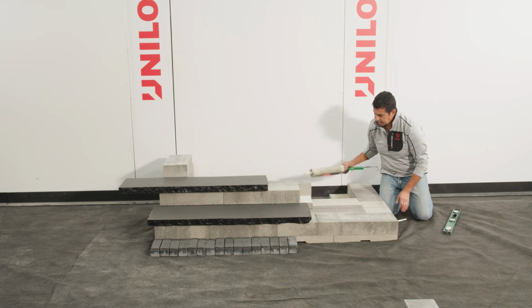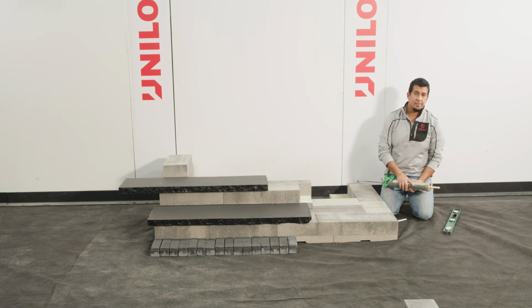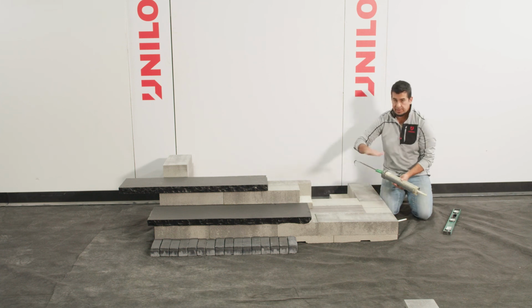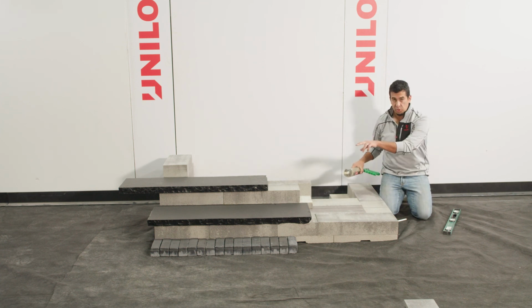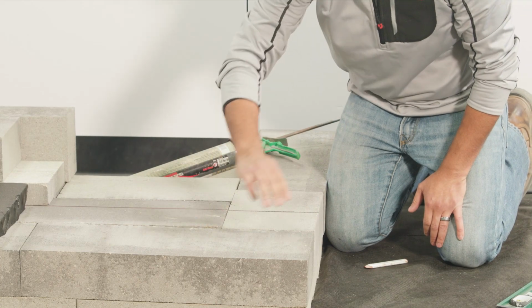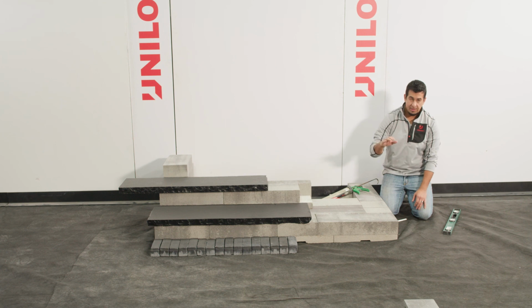The one thing also that is an important piece is your adhesive. Choose a very high caliber adhesive, and you're really going to want to make sure that you get a great surface adhesion from your stair tread or coping piece to your actual block. So this Lineo with the smooth surface, no grooves or anything like that, gives you great contact points along the whole area. And that is a quick step overview.